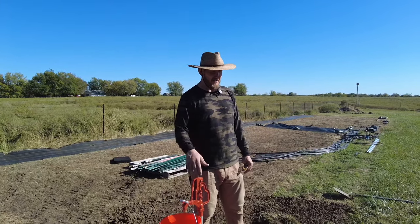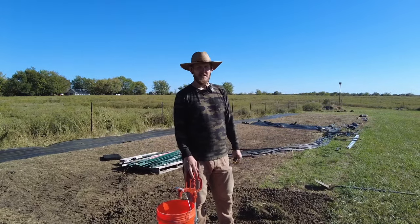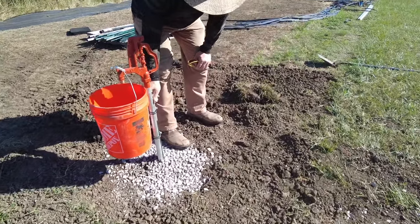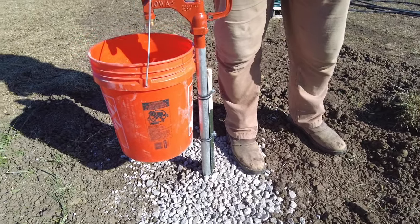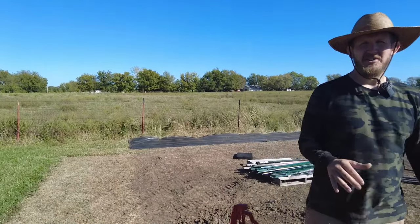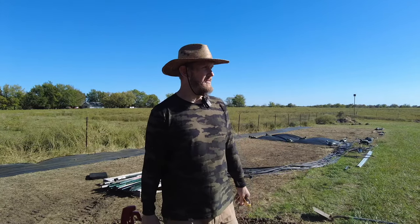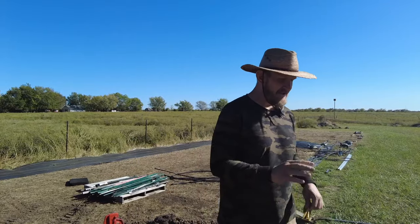But we tested this earlier today after we reseeded it, and for 4 hours there was nothing leaking out of the bottom. And if you also see, I used a T-post here to secure the yard hydrant so that it's extra rigid and keeps a lot of the flex off of it. So yeah, also trenchers move a lot slower than you realize. At 2 feet, you probably need to be barely moving. I think you're supposed to do a foot every minute. Otherwise it just seized up, at least at this size, and especially in clay soil.